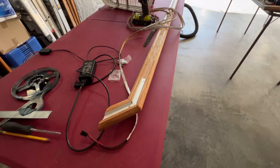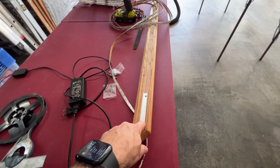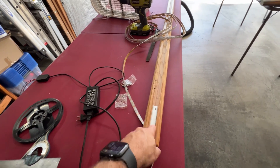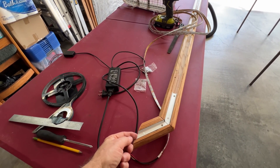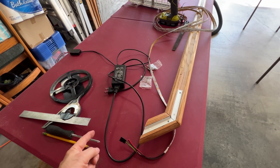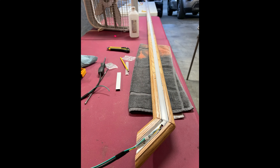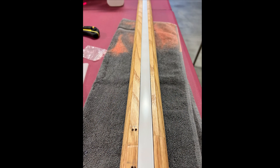Next I'm figuring out the wiring — the LED strip is going to start here and run all the way up, and the wire will come out through a hole I drilled in the wall and out the other side. Then I attached the channel by drilling and countersinking holes for small flat head screws. I wiped the channel clean with isopropyl alcohol and attached the LED strips with their adhesive tape. The final step of this process was to insert the diffuser into the channel, which helps diffuse the light and give it a sleek finished look.